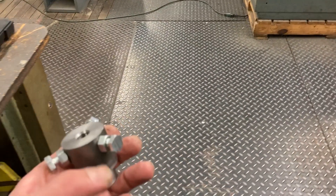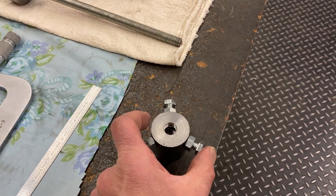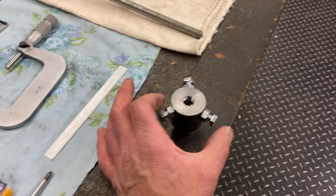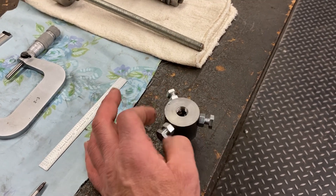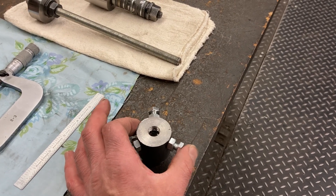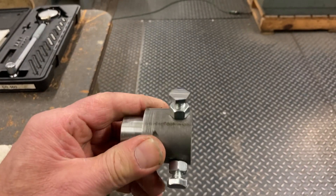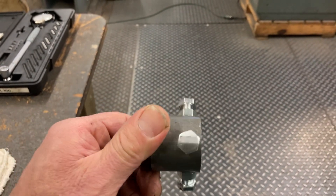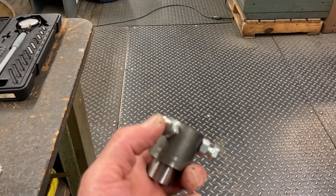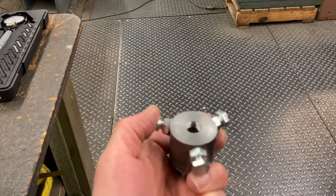With this spider, I set all the bolts to about the same length. I measured with the dial caliper — measured over each one, get it close, measured over that, get it close — all three. Then I put it in the spindle and indicated it so that it runs true. Then I took a tool and cut the OD so that all three bolts were the same length from the center out.